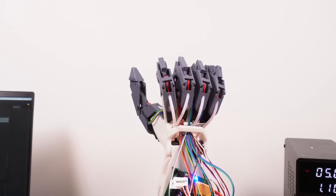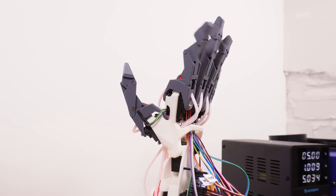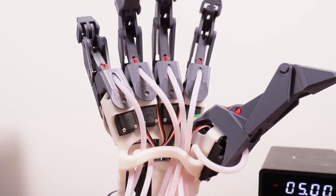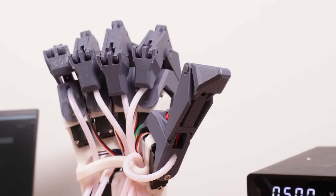I have to admit this is a brain-dump style of programming where I've just thrown down some lines of code and got something which works, but I'm pretty sure it's super inefficient. Each finger is its own instance of a class which separately checks and tracks its own position based on the time elapsed, but I think there must be a smarter way to check the time once and then update each finger based on one main clock. As a result I can see that I'm overstressing the processor and sometimes getting weird behavior — like when I have too many servos moving at once I'm getting some crosstalk with servos copying each other, and occasionally the fingers are just not cooperating at all.